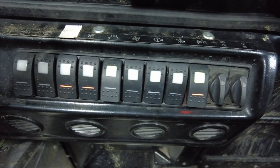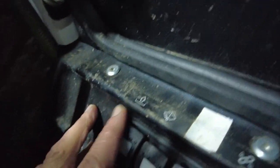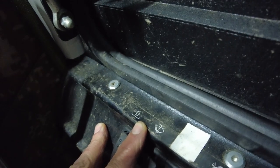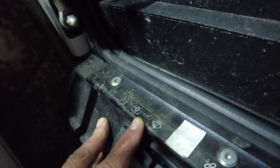We have a variety of different buttons inside the Sherp. Let's quickly go through each one. The first button right here changes the flapper valve inside of the exhaust, which redirects air into the tires. Before you push that button, you go right down here at the bottom underneath the driver's side and turn this valve, which opens up the airway to the inflation system for the tires.